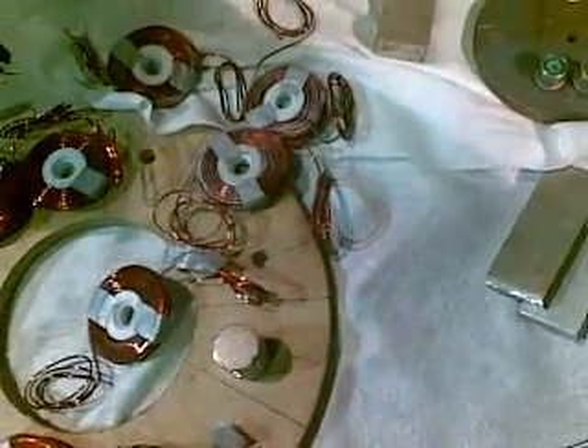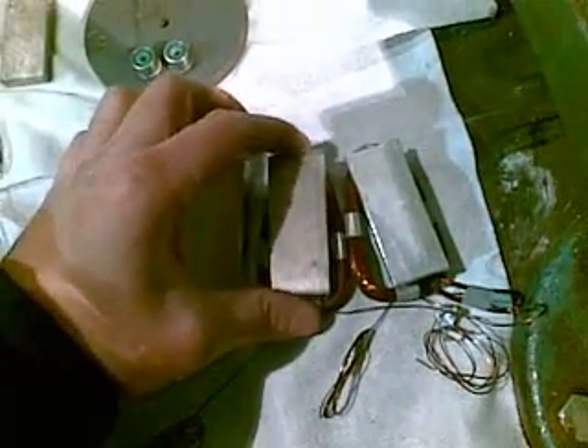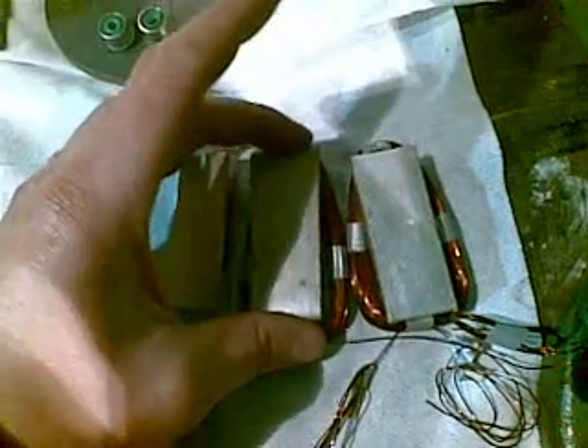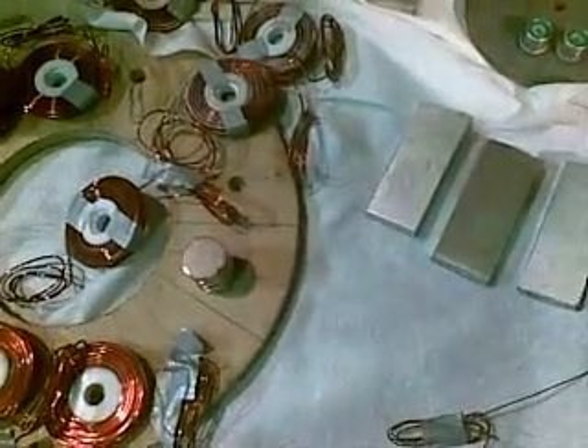Also difficult to find information about spacing between your magnets and coils. Imagine if these coils are part of your stator and these magnets are attached to your alternator, whizzing around at a hundred revs per minute or whatever speed. As one magnet is in the middle of the coil, the other magnet cannot touch the outside of the coil. As it goes around and comes out of the center, the other magnet on your alternator will just be connecting with the outside of the other coil. That's why there's a system in place - by general rule of thumb, use 12 magnets with 9 coils, or 16 magnets with 12 coils and so on. I've got a really good link I'm just going to post up on your screen now.